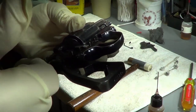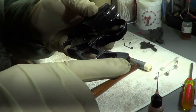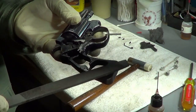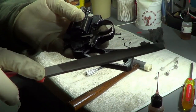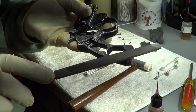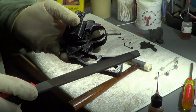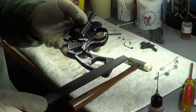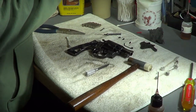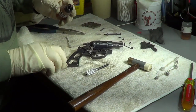This also had some little rough edges right here that were sticking up to where the grip couldn't fit. It looks like somebody took it apart and dropped it, or it was rusted and pitted. I could not rub my glove across here because of these sharp little edges. So I took a just a little file and smoothed off those edges right where the grips go. I took off those rough edges so my grip would fit better. That removed those points and allowed me to get oil on there without those sharp edges.